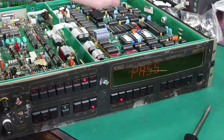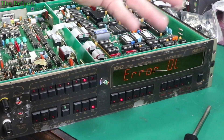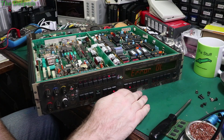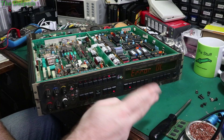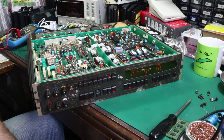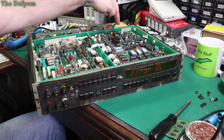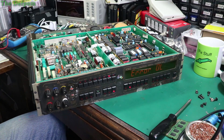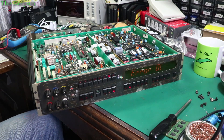I can't remember the sequence now. One will be the ohms board, one is the AC, one's DC. Error OL. My other unit is doing three errors; actually no, it's doing two — the other two errors. So this one's got some different ones but similar. Error OL won't go away. On my other unit I actually found that this adjustment in the back here, L2, wasn't set correctly. And once I corrected that, the error OL went away. So it's probably the same problem. That's the PLL adjustment for the 50 hertz line frequency — at least in my case, 50 hertz.